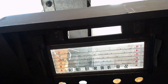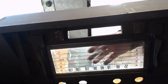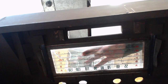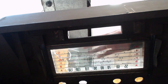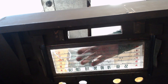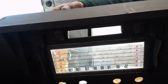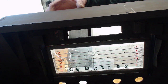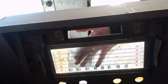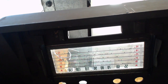I'll just say a couple of things about that. You can't be cautious enough when you go to clean these pieces of glass. A lot of them have writing on both sides, not on one side. Like this one. My hand's on the outside surface. I can feel the paint for it. The stuff on the top side is usually really strong because it had to take a lot of cleanings. The stuff in behind here, though, maybe not. And more than once, I've done my best to not wipe off any numbers, and yet I've wiped off a number. So just super caution on this kind of stuff. This is the radio. Ruin this, the radio's ruined. Don't ruin it. That's my words of advice, and I will now go about cleaning that one.